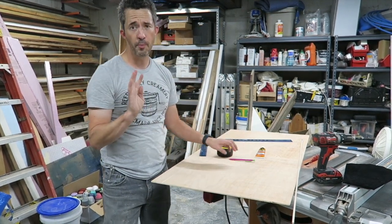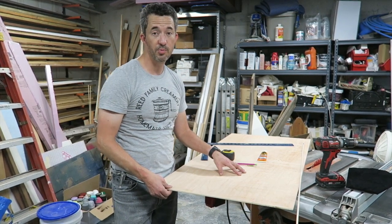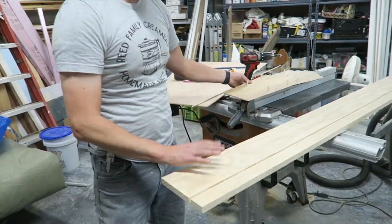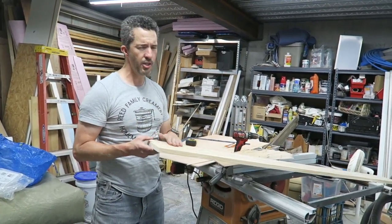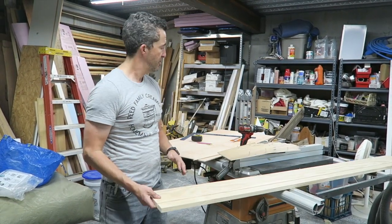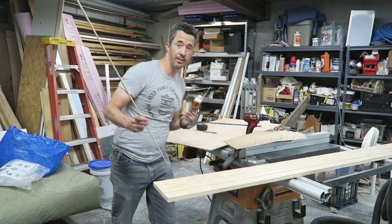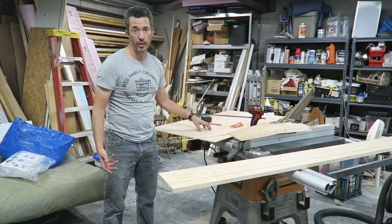There are four pieces of material you're going to need: a piece of quarter-inch underlayment — you can find this in the plywood section at Home Depot or Lowe's — a quarter-inch dowel rod, some wood glue, and for the base, a one-by-eight board. Get the select or surfaced-four-sides piece — it's going to be the nicer piece. Really only four things: one-by-eight, quarter-inch underlayment, quarter-inch dowel rod, and glue. All told, you'll probably spend about 20 bucks to make five or six of these.